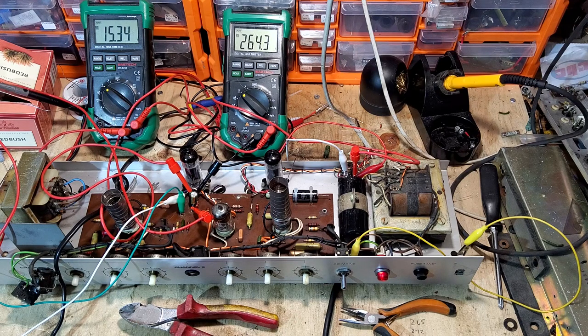So it's all a balancing act, and I think we've got that about right. With 50 volts over on the plates, honestly I don't think that'll matter given these are Russian tubes. People use EL84s pushing 140 volts over what they're capable of - I've seen amps with 440 volts on the plate on an EL84 when the data sheet says 300 volts limiting. We're only 50 volts over on the plate and 13-14 volts over on the screen.